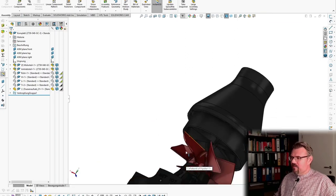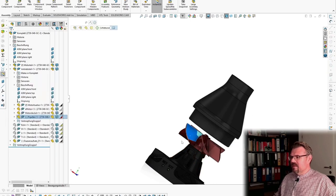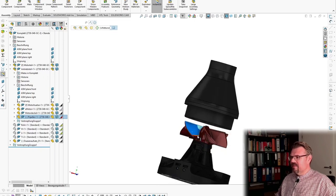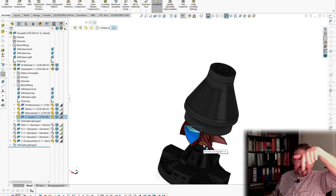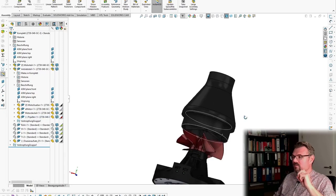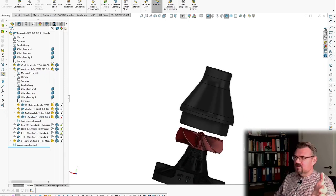Why are those guide vanes necessary? You know, this rotor is spinning in this direction. Huh? So it will accelerate the air in this direction. But not only in this direction, it will also spin the air. Yeah? Because, you know, what we've seen, like the ball was dancing inside. We've seen this must be some sort of whirlwind. Let's call it whirlwind. Yeah? So we need to straighten this out.